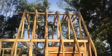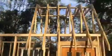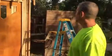We got all the windows framed in, we got the door framed in. I got to shim the door and screw it down. We got half the trusses set, the other half are going up Sunday, and then I'm going to put T111 on the outside and that's going to be about it.